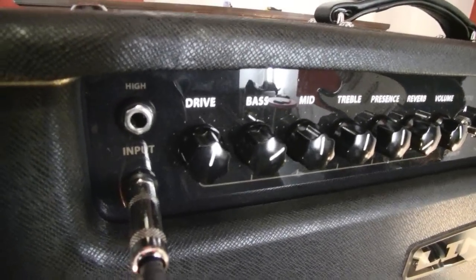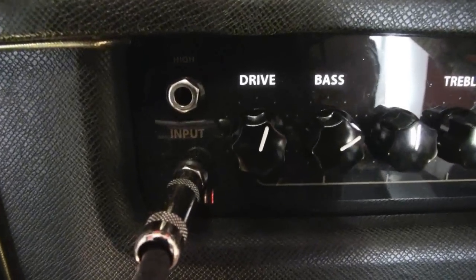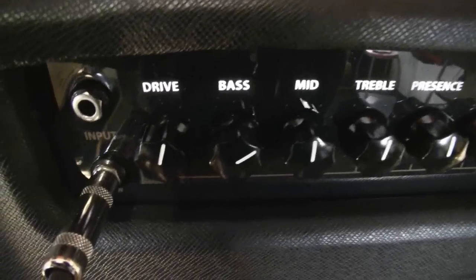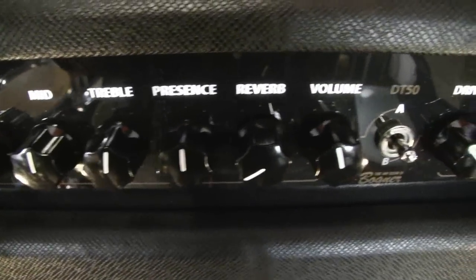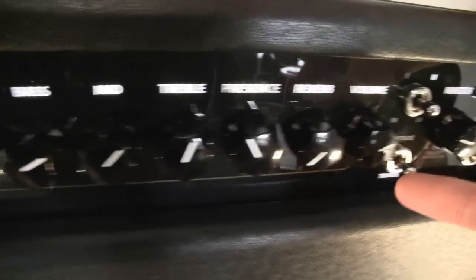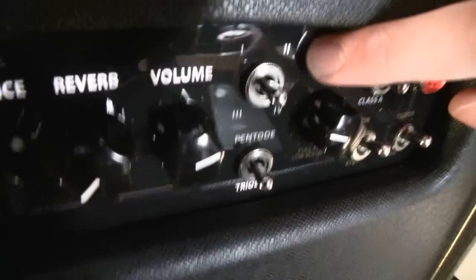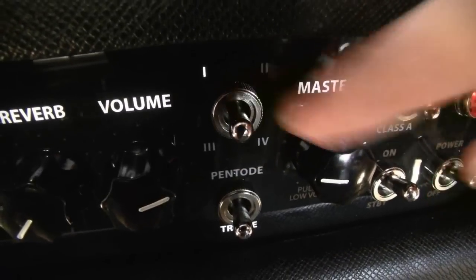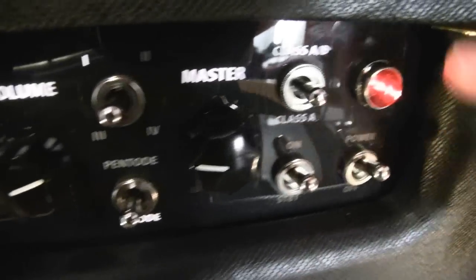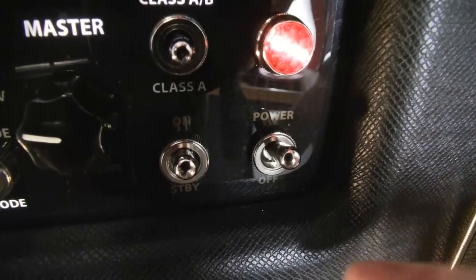Let's have a look at the front panel and see what's on there. We've got 2 inputs, a high and a low gain input. I'm going through the low gain because I'm using a humbucker today. We've got 2 channels on the DT50. On those channels, what you'd expect to see on a classic amp: drive, bass, mid, treble, presence, reverb and volume. There's our channel selector there, I'll tell you more about that later. Then we have our voicing system, which can go from 1 to 4, and then pentode or triode, master volume, the class of the amp that we're using, and then just standby and power. Pretty simple really.